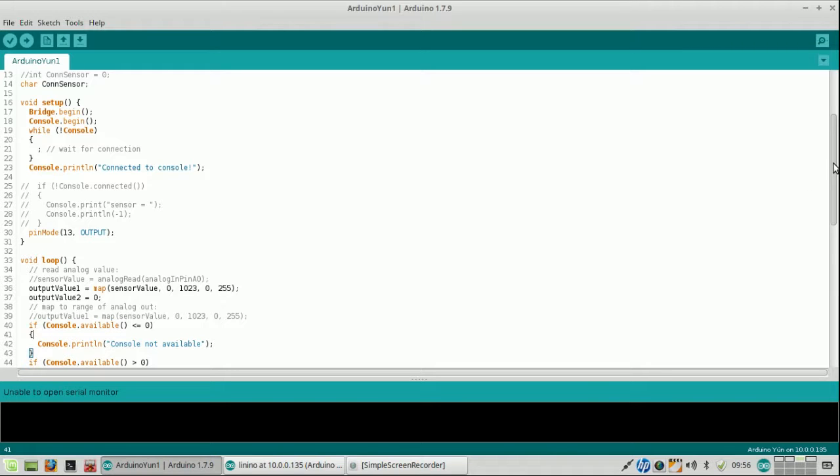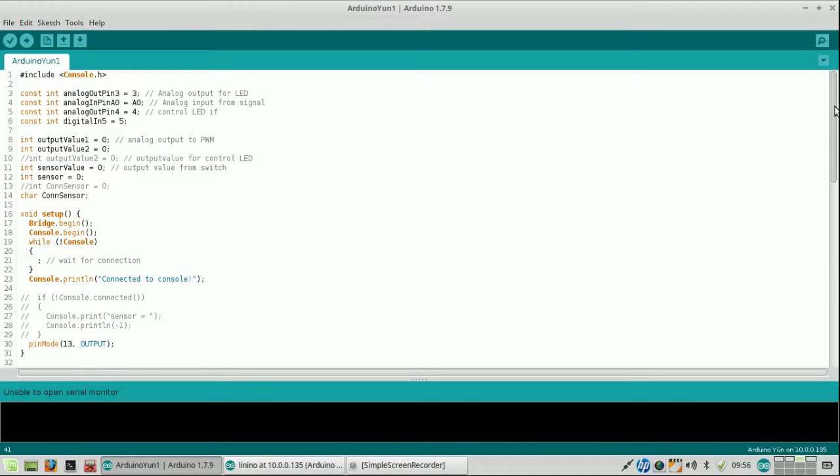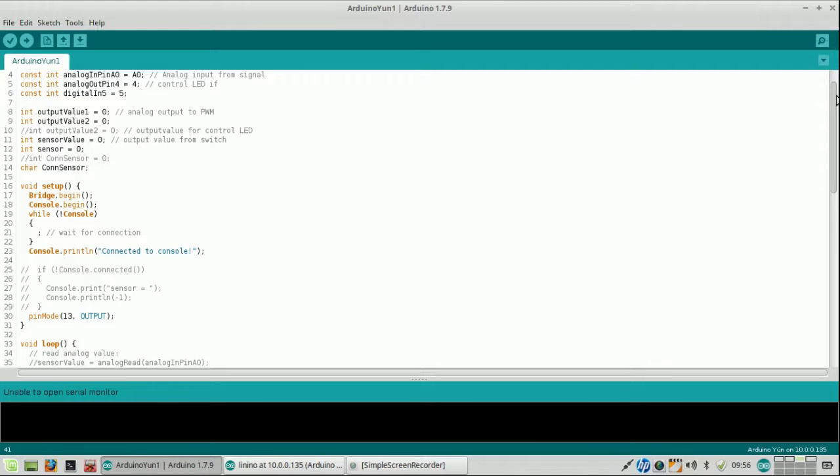So the problem is now that the LED, which was replaced and is controlled by pin 3, isn't doing anything at all. Now here it says analog output, or analog out pin 3 is 3, and the point is that this LED 4 is working. So first conclusion is that the way this is set up or initialized is correct. Then we'll have to look further.